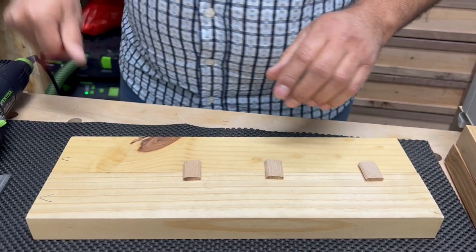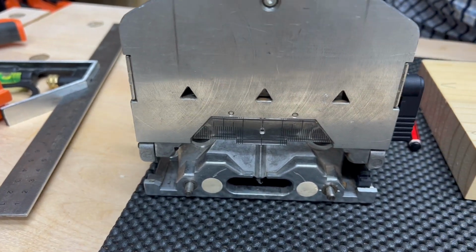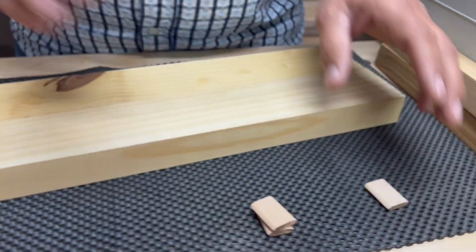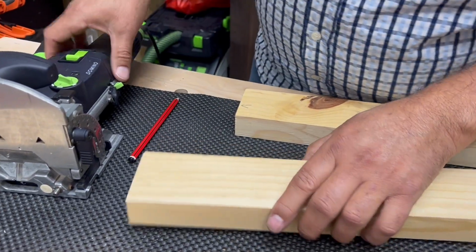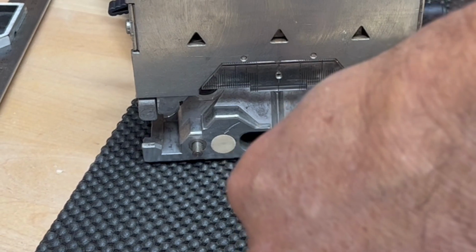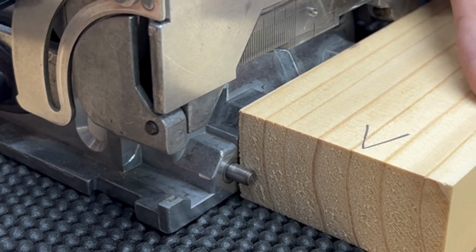With the machine over here, in front of the machine, there are these two pins. So when we actually do our first, that's the older version. The newer version comes with these little levers over here, but it works basically the same. So your first hole that you're actually going to drill is not a measurement. That gets determined by the machine, because that pin is going to be pushed in when I push it up against the wood. That one is going to hit up against the front of the wood over here. So we're going to plunge that in, and that's actually going to the side over here. I still have to set the depth of that, so we'll actually get there right now.